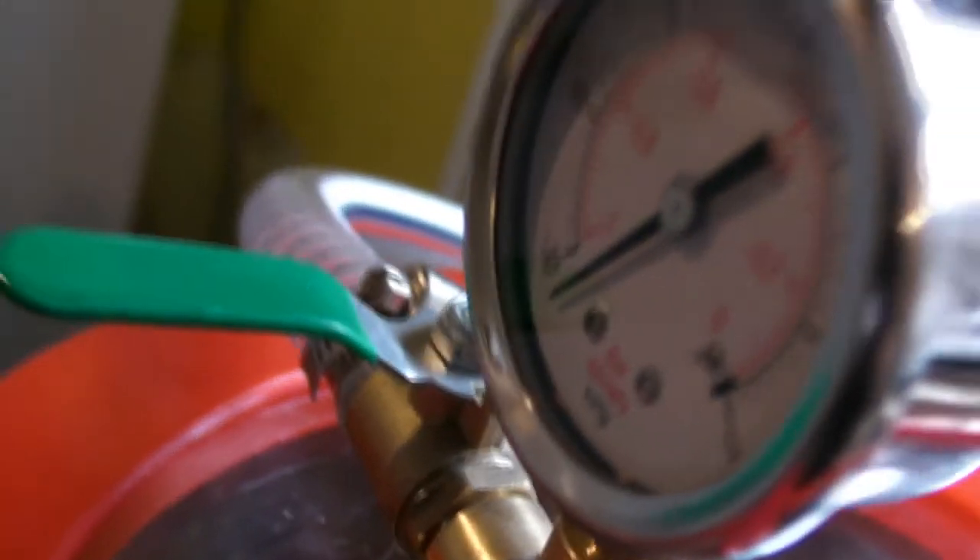We've been under vacuum for about half an hour. It's still holding and the amount of bubbles coming out of the Blue John - it's just struggling to focus with the big acrylic lid on the vacuum chamber - have decreased significantly, and ditto with the amber. The resin is really getting into the nooks and crannies on the inside, but there's still exchange going on so I'll leave it. It's still under a full vacuum so there's no reason to disturb it yet.